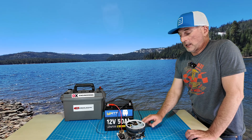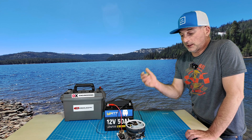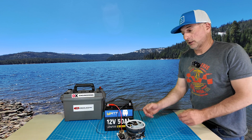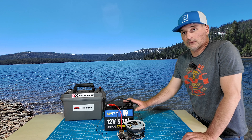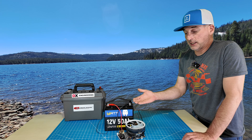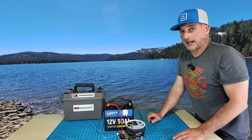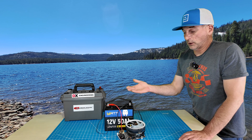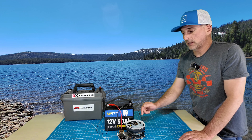Let's put it to the real test. What I have here is a battery capacity tester, which is essentially a heater with a big heat sink and a cooling fan. I can adjust the current draw on it. I'm going to put a 10-amp constant current draw on this. If it is a 50 amp hour battery, divide that by 10 — it should get at least five hours of use. This will also monitor and tell you the exact milliamp hours, because what if it goes a little more or less than five hours? It might be under or over the 50 amp hours — that's what we're here to test and find out.